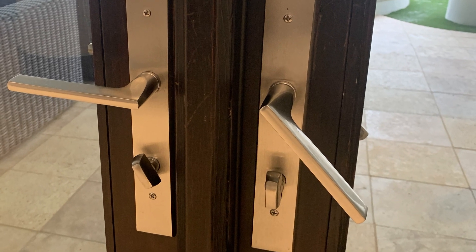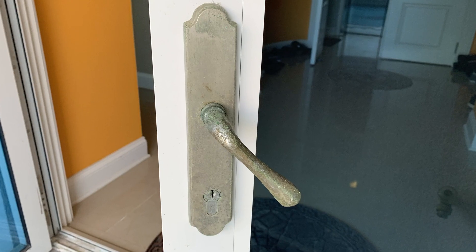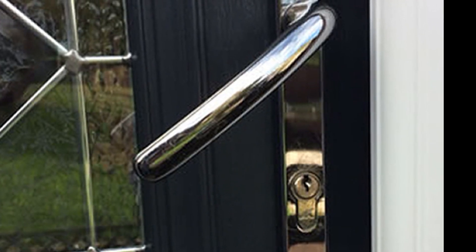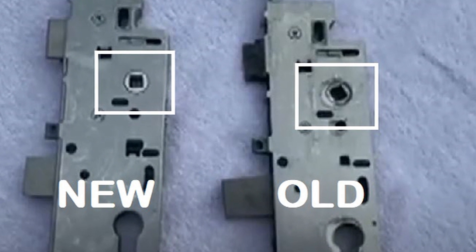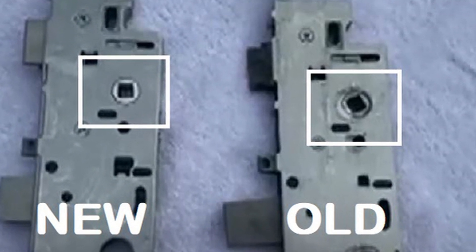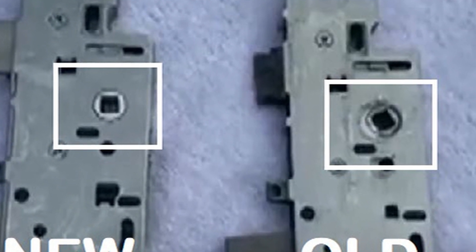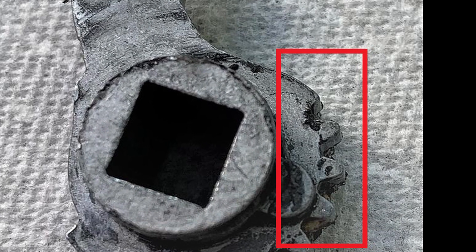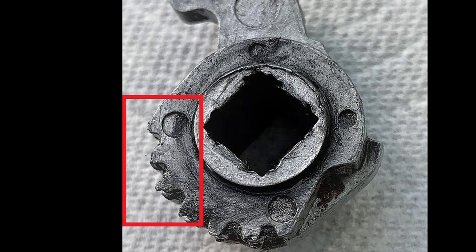If you found this, it's probably because you have a sagging handle or a multi-point lock that's just not working — maybe it's locked down. Typically when you have this, it's either a return spring or the gear cog on the inside that causes failure. That's typical on just about any multi-point door lock. On the picture, you'll see a new gearbox on the left and a failed gearbox on the right. Notice how the square sits square on the new one, whereas on the old one it appears more like a diamond. The gear cog is either missing teeth or the return spring is broken — the teeth get worn down into nubs and start skipping over the drive rail.